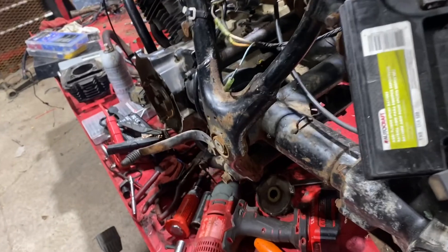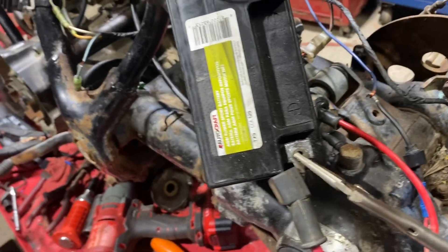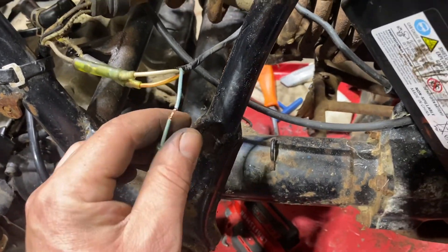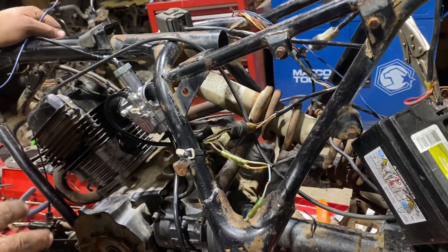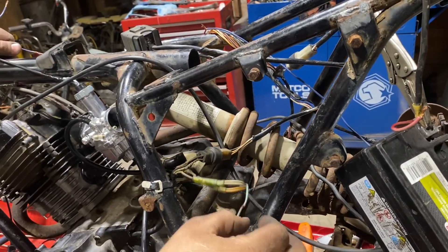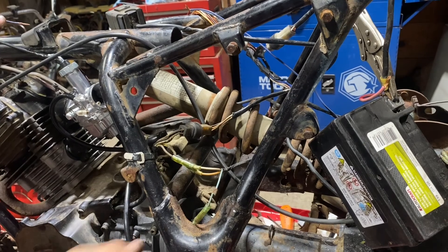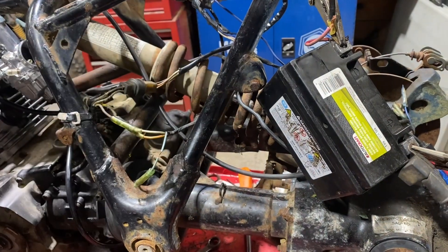We went through and pulled the harness off the other machine that was on the bench. What we determined - the reason we weren't getting a crank - is on the back end of this harness there's a light blue wire and it needs to be connected to a ground and also to the negative on the battery. That seems to be our issue with no crank, no start. By putting a direct ground into the harness from the battery it made everything kick right over like it's supposed to. We're just going to splice in a wire, put a heat shrink tube on there, and call it a day.